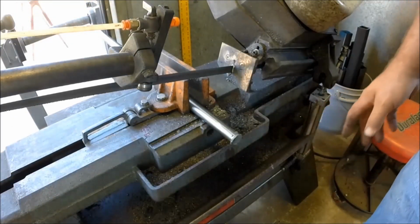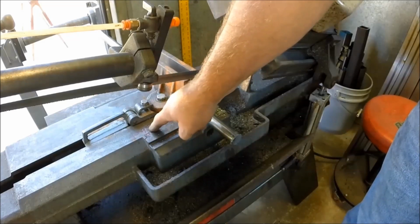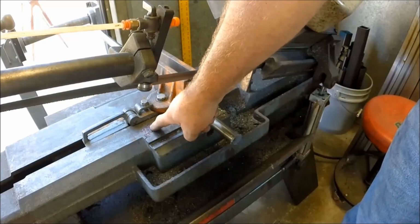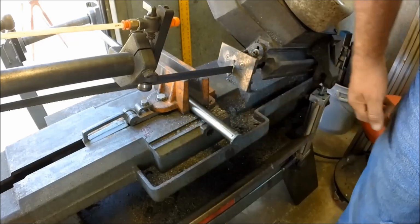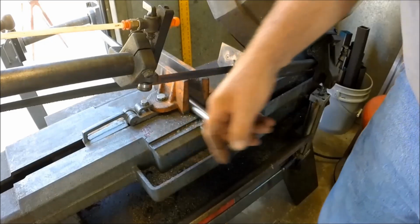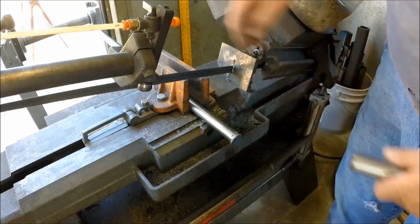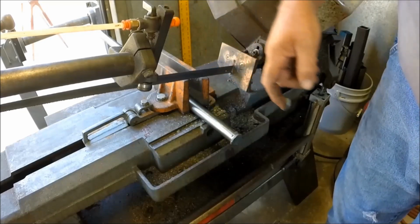Okay, so after our last cut, I recorded it here. AL is Anchor Lube, so with our Anchor Lube, our surface temperature was 95 degrees by the time we got down to the end of the cut, on the butt end of the main stock. Down here I've left a place for the Rapid Tap. So we're going to cut it again. There's still some Anchor Lube goo over here. Let me get that out of here.